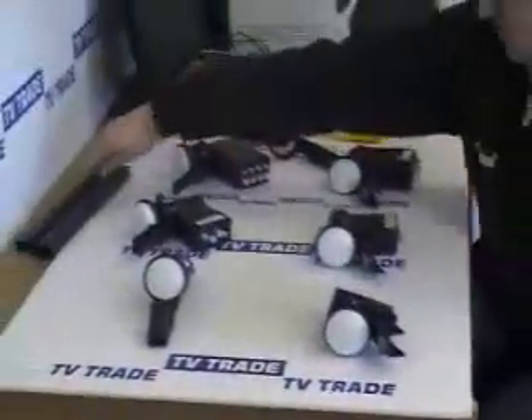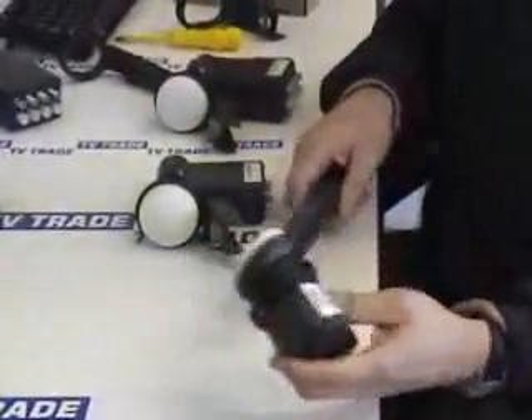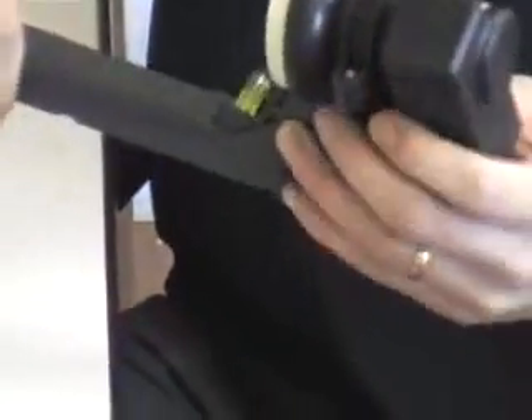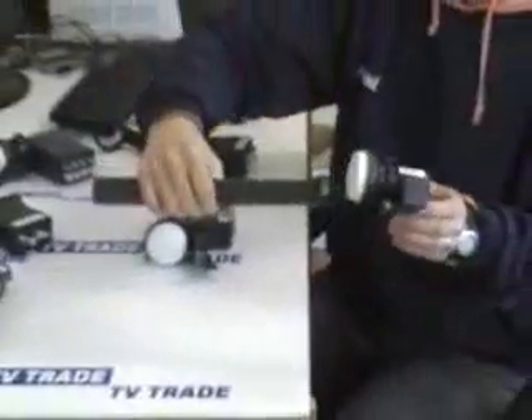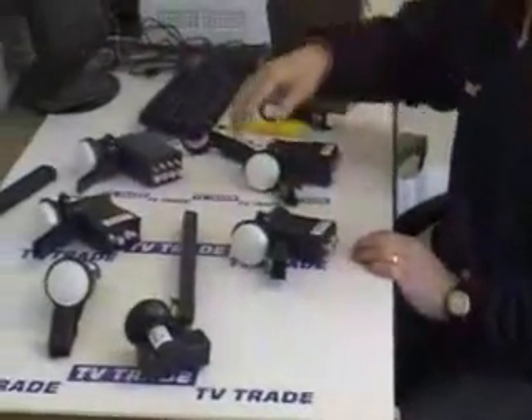For the new style mark four LNBs, just to show you how you would actually insert this — they're very easy to put on, but be warned, they're very difficult to take off. What we do here is we simply get the LNB, we snap it down here, we push the end of it up to this plastic insert, and then we just apply pressure down, and it simply snaps into position. And that's it, the LNB has been placed onto the dish. It's exactly the same process for putting on a quad or an octo LNB.